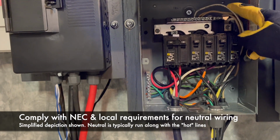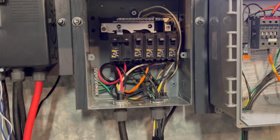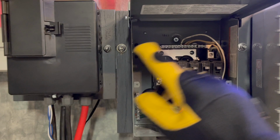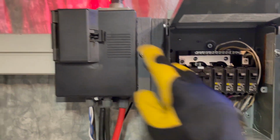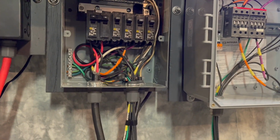If multi-wire or shared neutral circuits are found, keep the phases the same as you found them so you don't overload neutral wiring. It's a best practice to keep items phased as they were. L1 should stay connected to L1. L2 still is L2. Mark them before you remove and relocate the wires.